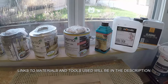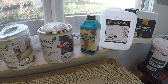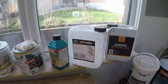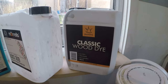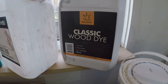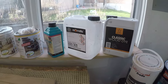These are coloured, and this one is completely transparent and won't give you the wet look. Other finishes are varnishes — they give you a hard layer on top of the wood, a bit like a lacquer, applied with a brush or roller. There's also a dye, which goes on with a brush, roller, or rag — you wipe it on and buffer it off — but it's just a thin layer, not really giving your wood protection like oil, and it doesn't keep your timber moist.